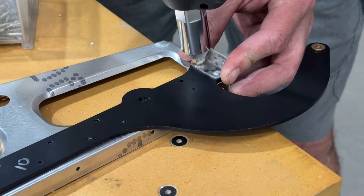Everything is perfect. The aileron was hitting the extrusion, but I was able to clear that and everything clears with nothing rubbing. The flap is all good too — everything lined right up. It's close, maybe 3/32nds to an eighth clearance, but nothing rubs. Everything lines up nicely. I think it's officially ready to get some skinning done after I run my wiring for the landing lights and all the other lights.